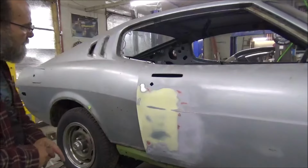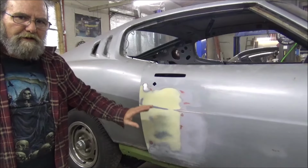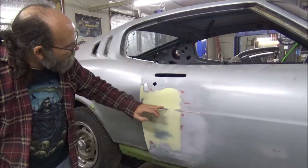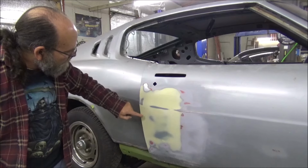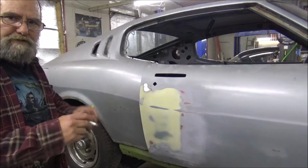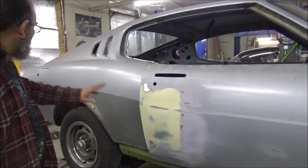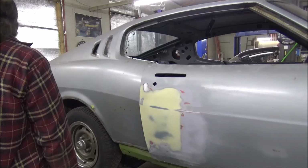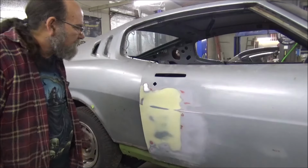All right, guys. Jimmy come by and sanded this down. It started with some 80 and then finished it up with some 400. You still see some sanding scratches. There's little nibs here and there. But we're going to take care of that. What we'll do, we'll take some of our icing and mix it up and get it on there. That will take care of them little problems. Same way with the back, you need very little icing on the hatch, right? Yeah, the hatch piece turned out almost perfect.